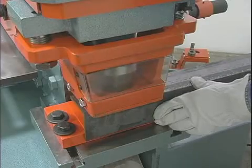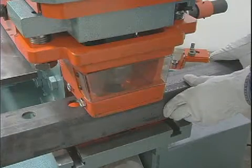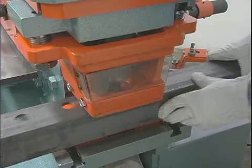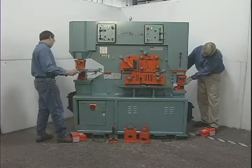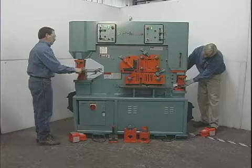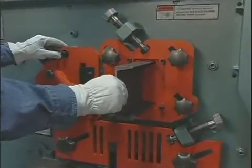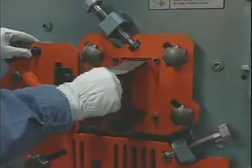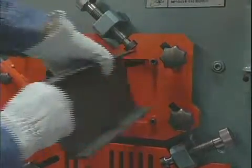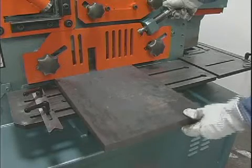The tonnage of all ironworkers is determined by the machine's punching capacity. It is very important when comparing ironworkers to compare the capacities of all the machine stations, not just the punch. One other thing to watch for when you are comparison shopping is the rated tonnage versus the rated capacity. You will often see machines rated with 70 tons of pressure, but the rated capacity will be up to 10 or 15 percent below that.